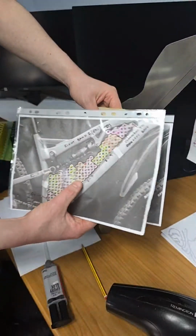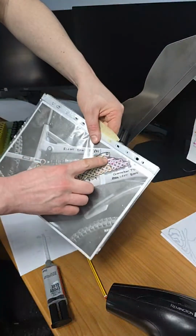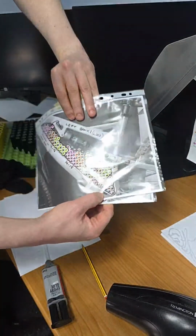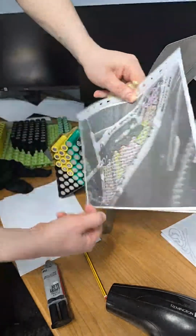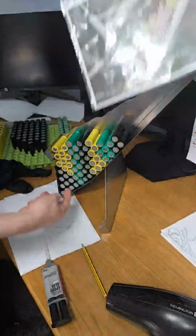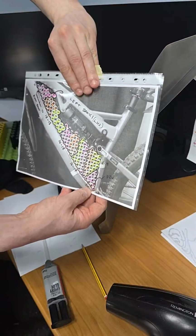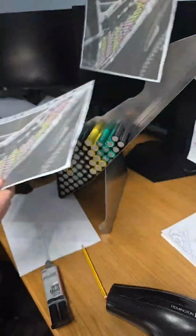So if you can imagine the 2 banks placed together like this, and then we'll have a series connection here linking this 36 volt pack to this 36 volt pack. The positive polarity, 72 volts or 84 volts, is at this terminal, and 0 volts on here where we're at now at the minute. So when I come to this side, yeah, that's it. So I'm going to stick this back up and move on.